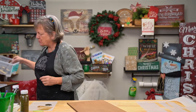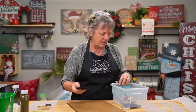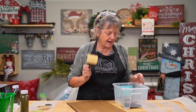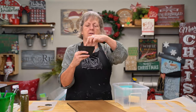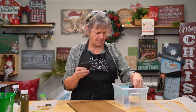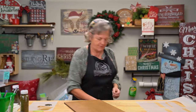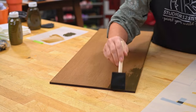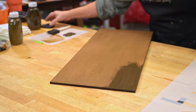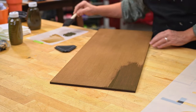Now we're going to do some wood grain. There are a couple of tools you can use — a simple serrated tool to pull through your paint, or a rocker to get a grain. For today I'm going to use the one with graduated teeth — not the same width. We work kind of quickly, get another foam brush out, put this color over that color, stripe it down along, and that will give you a wood effect.